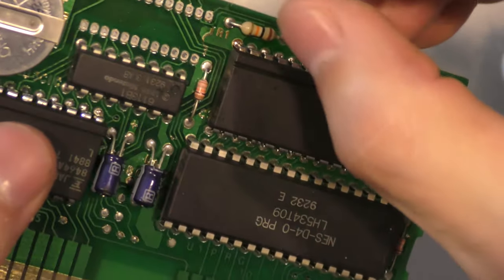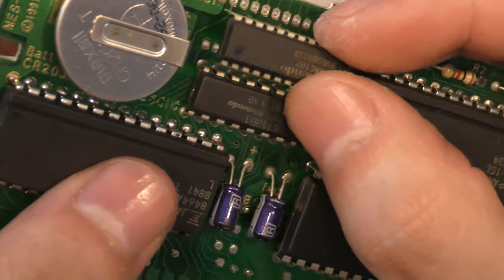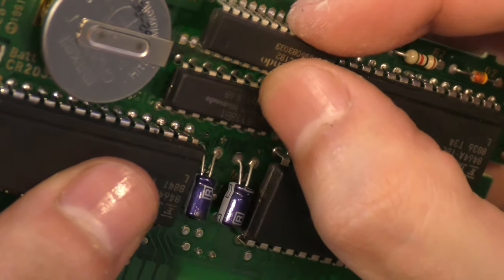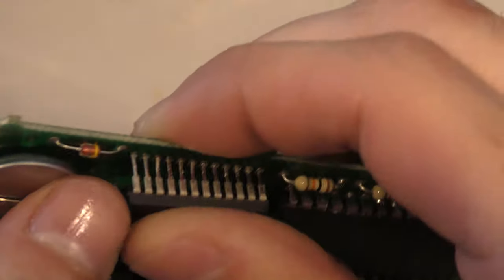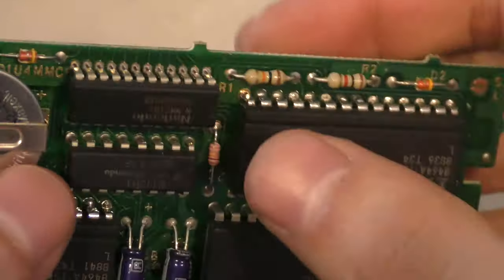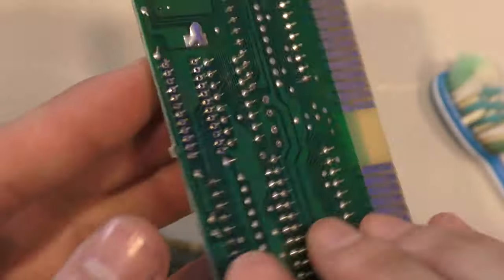So I believe that both chips are the same. Maybe the 3 is a later revision of the same chip. I don't think they have different functionality or anything. So I am going to swap it with a 1B2. Plus, since the cart database lists a 1B2, I know that it is compatible. I can't mess anything up. So let's see what's going on. Let's see if it works.